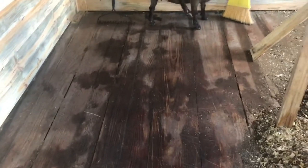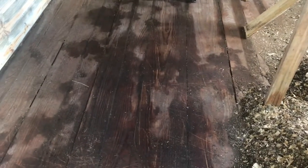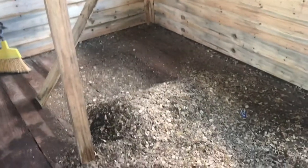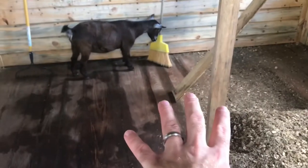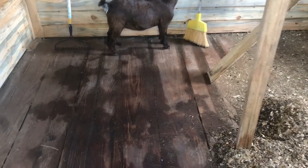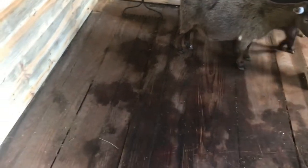I swept out this whole corner and I'm going to get the first 4x8 sheet of plywood thrown down, then shovel the bedding back on top to move it out of the way, and sweep that corner clean. The plywood slips underneath the siding, so we'll slip that corner piece in. There'll be a gap in the middle that we'll have to trim just a little bit and drop in as a kind of keyway piece. I won't do the actual flooring on the other half until the wall board and door area are done.